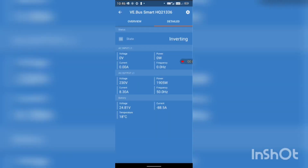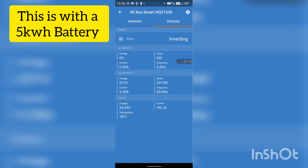We're going to do 45 minutes at 30 degrees and then put on an extra spin to get extra water out, and we're going to see what it does to the house batteries. Just running the washing machine immediately pulls 2000 watts out of the house batteries and takes it down to a critical level of 24.6 volts. We're only getting a couple of hundred watts coming in from the solar, so the batteries are going to be dead by the time the load finishes with no reserve left to power the house.